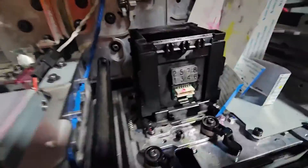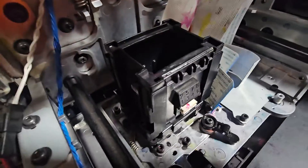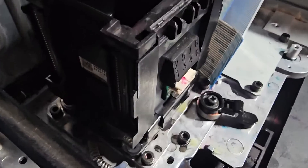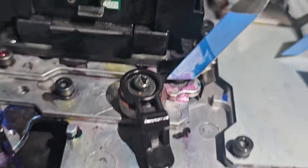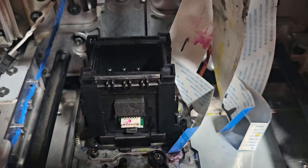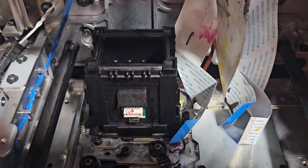So that's what we're going to do now. I'm going to clean up this area a little bit better. There are two screws which are kind of hard to see — two Allen wrench screws. There's one right there, and we've got another one on this side in the back. That's what we're going to use to get this printhead out of here. I'm going to go ahead and pause the video and we'll be right back.